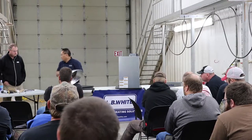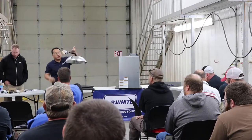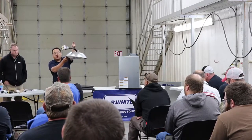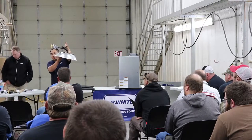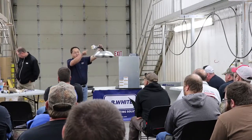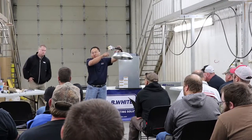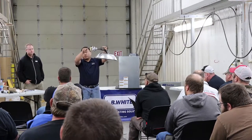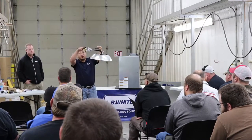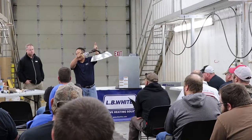First thing I want to point out is the installation. If you get out there and you see this guy comes in this way, what's going to happen? The heat is going to ride back. If you have a filter here, eventually that filter is going to get burned out. If you have a hole, eventually it's going to start melting that hole. When you get out there, take a look and make sure it's at least one to three degrees bends outward.